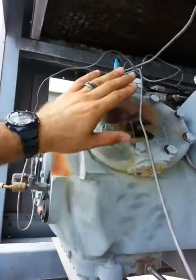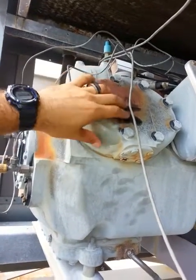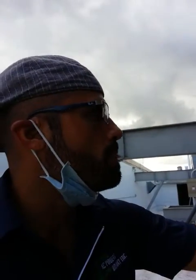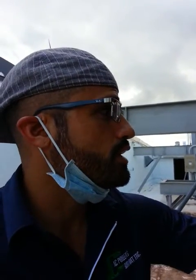Here we are — your head cover plate here is burning up. The cause of that is lack of oil. Valve plates, piston rings — they could be just wearing out and pushing that oil through the system, which is not a good thing.